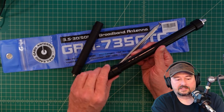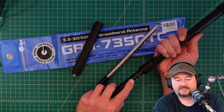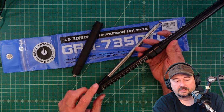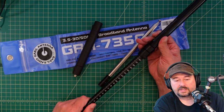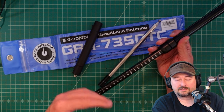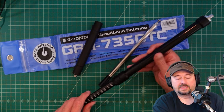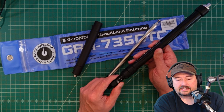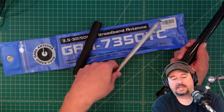At the bottom of this adjustable coil, you can loosen this and then you can pull this out. And it looks like they have these etched in here. I'm not 100% sure, maybe it's paint, but it feels like an etching, which is nice because that means it won't wear off. A scale, looks like 1 all the way up through 18. What would be really cool is if they had frequency designations, but you probably can't do that because you could use this or a different antenna whip at the top, and it would have to take that into consideration. But you adjust this to add inductance. I'm assuming the longer you go, the more inductance you're adding to cancel out any capacitive reactance that you have in this antenna.